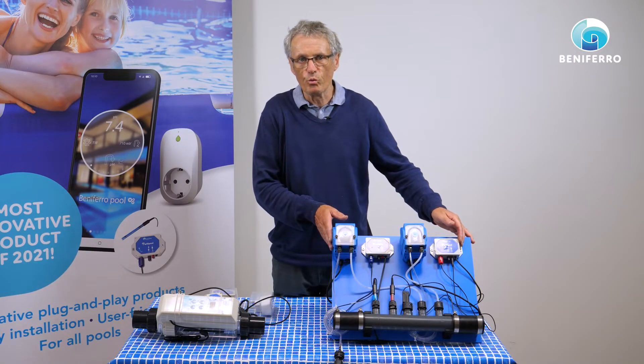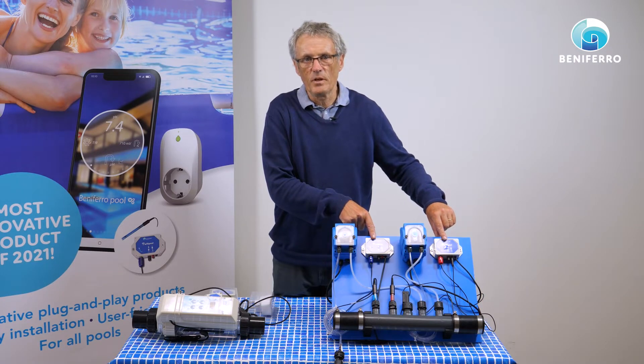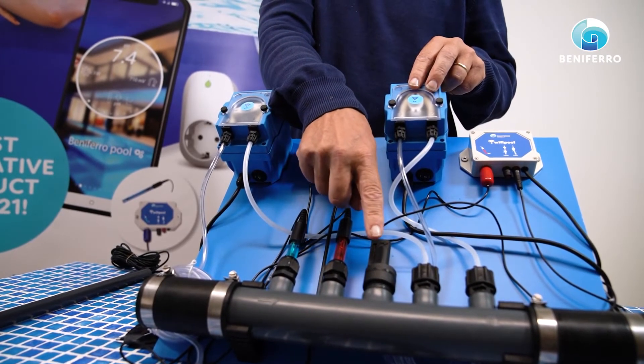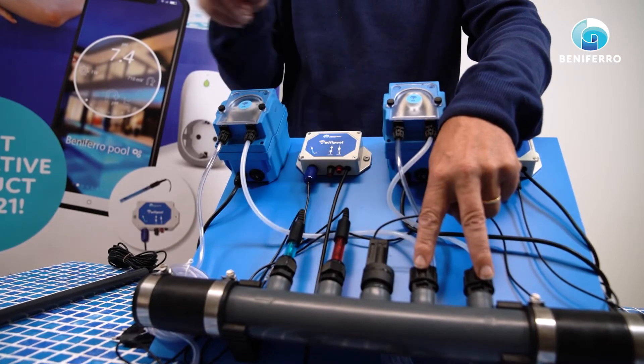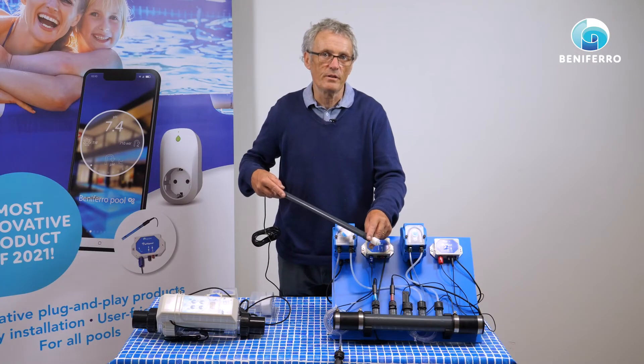We don't only have a salt electrolysis plate. We have also made a Wi-Fi pool twin mounted on a plate — twin because we have two peristaltic pumps. This unit has a pH and a redox peristaltic pump. They are Wi-Fi enabled and powered only if our measuring tube indicates the pH is too high or the redox is too low, which will activate the pumps. Again, everything is pre-mounted, with a dosing and measuring tube including a flow switch and dosing nipples. We also have the possibility to connect level switches to the measurement tools, so we can measure the level of chlorine and acid in the containers, which will stop the dosing pump if the level is too low.